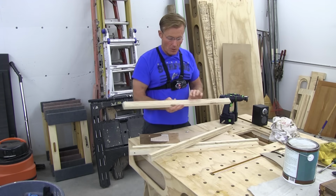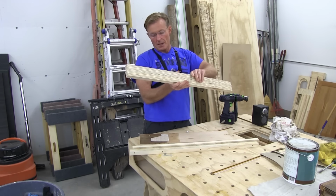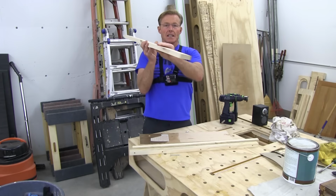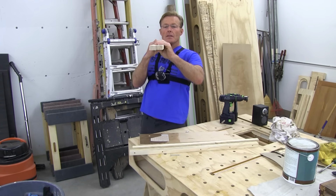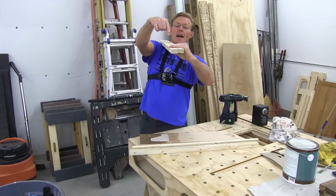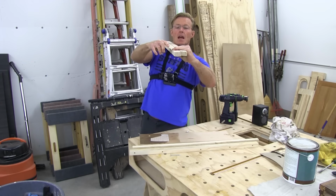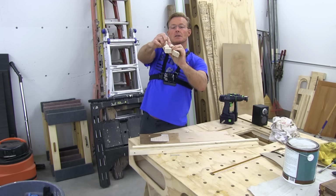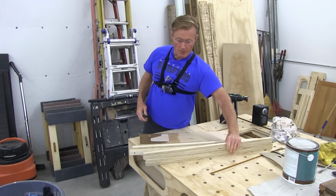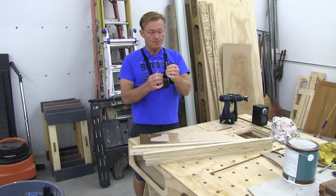And then I will take the second one and I will screw it to the first one with the same power head screws offset. And then it'll be sticking out from the wall that much. And then I'll slide the floating shelf onto it. And then I'm going to attach through the floating shelf with screws, three screws across the top, and I'm going to come in to the second lamination midway, and I'll pre-drill. And what I'm going to use for those screws is the same power head screws, but I'm going to use a 2-inch screw.